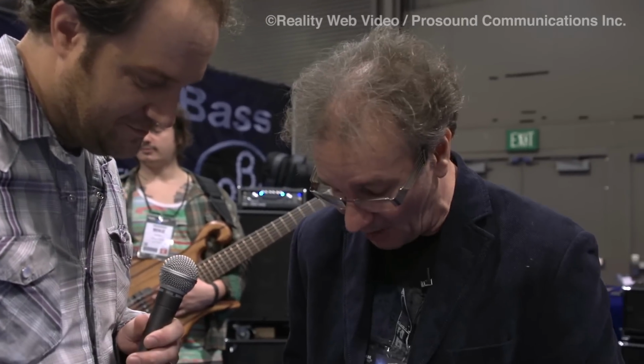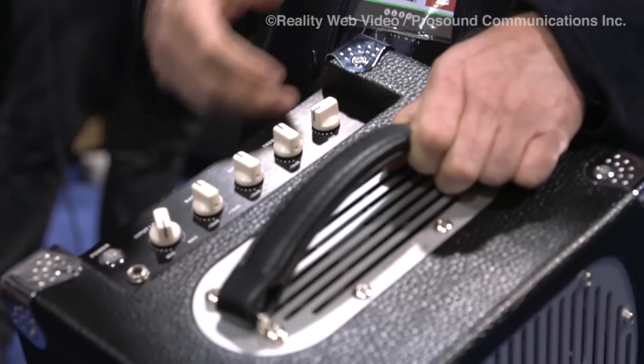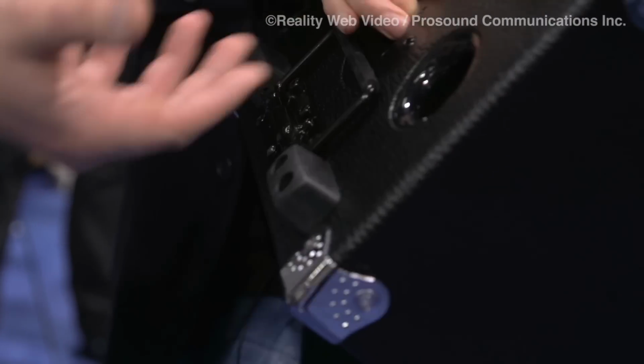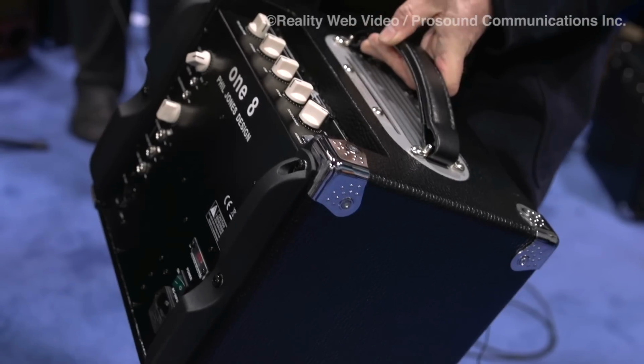And we've got a patent applied for on the vent here, which is convector cooling. How it works is that it's a vented speaker to give you some more bass. There are two vents here that suck the air in from the bottom. The speaker heats up the air, the hot air rises, the cold air comes in and keeps the speaker cool. We got 30% more power handling out of that, which is reliable. We don't want a blown speaker at the end of the night.